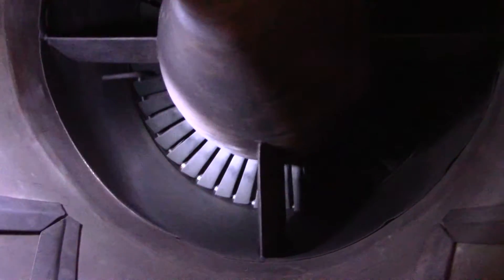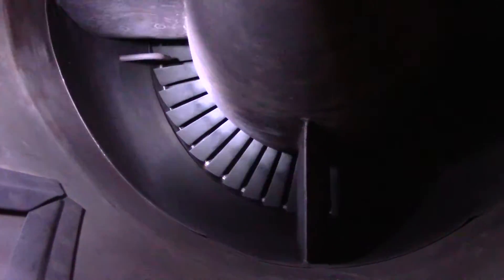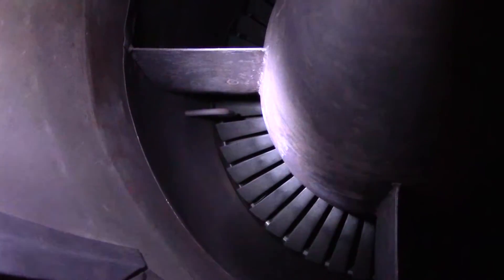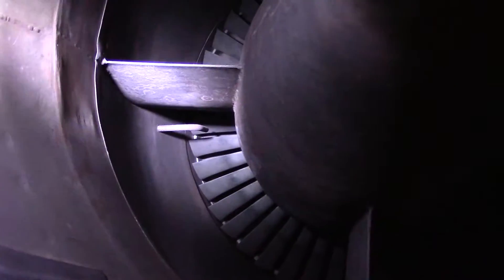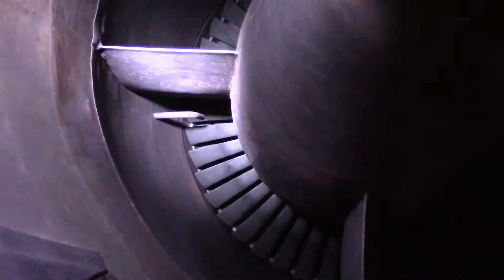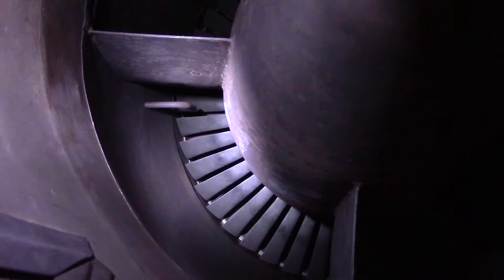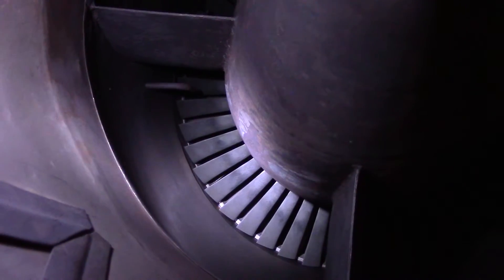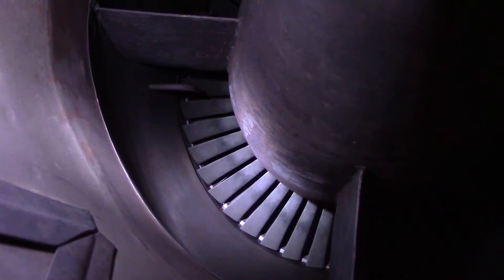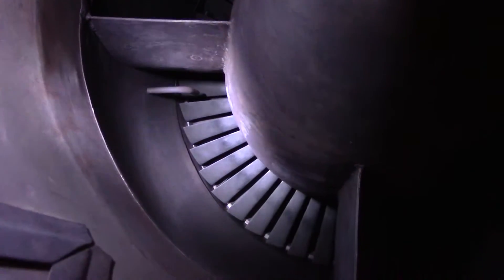As you can see looking in there, the turbine blades kind of block view of the nozzle. But if you look through there and know what you're looking for, there's actually about three right in this spot — just south of the nine o'clock position, roughly 8:00 to 8:40 on the clock dial.